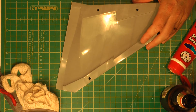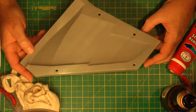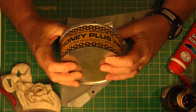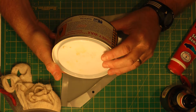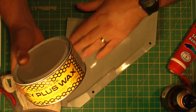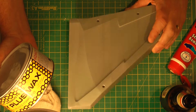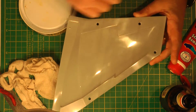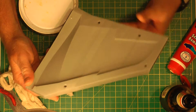So basically that's the part cut. The last thing I normally do is add a couple of coats of honey wax, just to get ready for casting. When I do the casting I'll do another set of videos on how I prep the moulds for casting. But that'll be a while yet because I've got another three of these to complete — another cavity to do and two cores still to do.